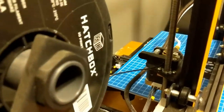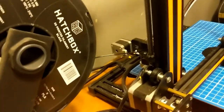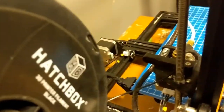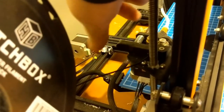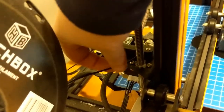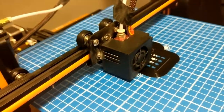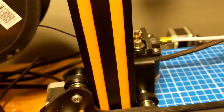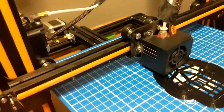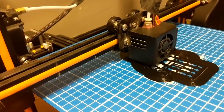The other really easy thing to do with this printer is load it. So you've got essentially a clamping mechanism here. You squeeze it closed and it opens up the orifice to feed the line into, and then you feed the line and it goes all the way down to the printhead. Once the temperature gets reached, there are little mechanisms in there that force feed the wire into the tube and push it out into the hot nozzle end. The hot nozzle end heats up the plastic, and then it deposits it on your bed.